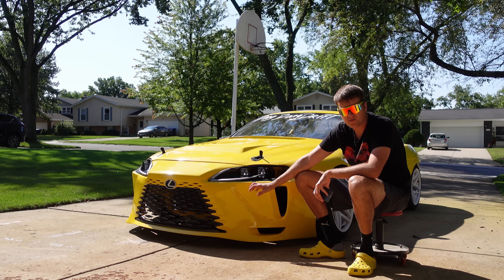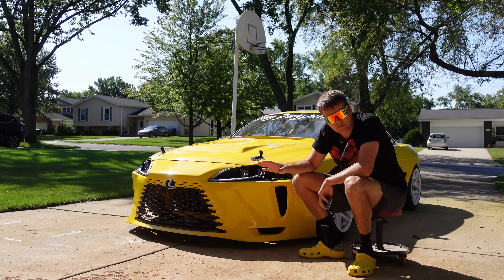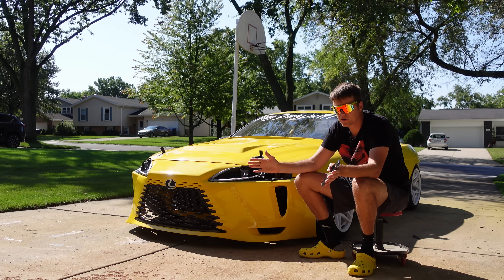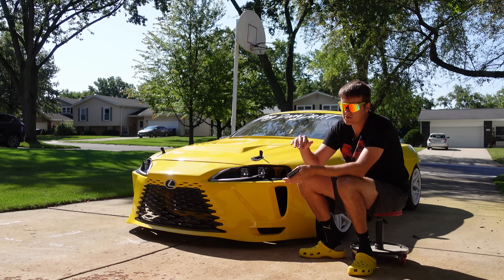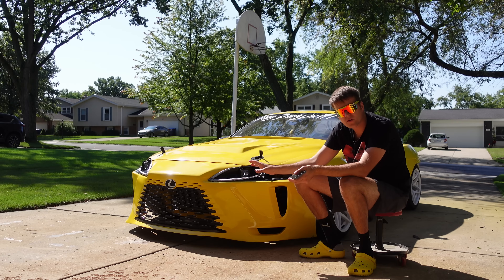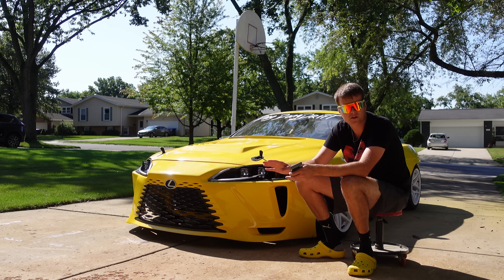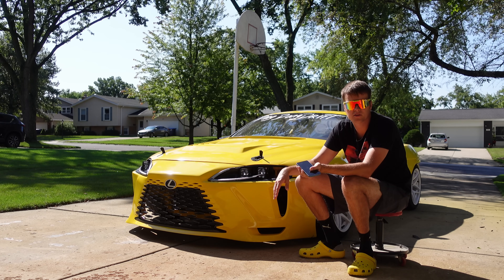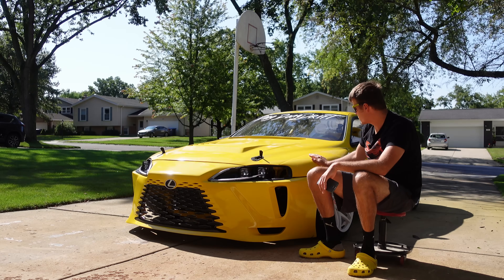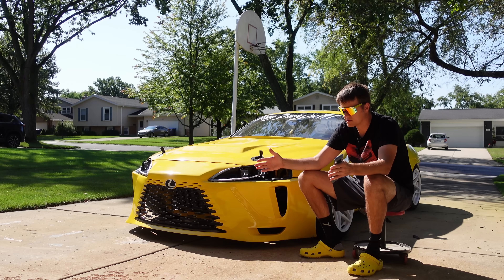PETG is a great material — you just have to design things so they have enough thermal mass and plenty of perimeters. This entire bumper is printed with four perimeters and five percent gyroid infill. A big misconception: infill does not add strength. Infill does nothing except support the walls from caving in and support top layers — it's just support material. If you have four perimeters, your print will be the same strength at zero infill as at 50% infill. You need more perimeters, not more infill.